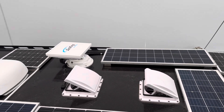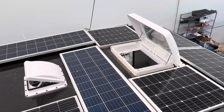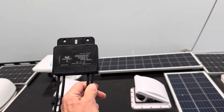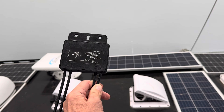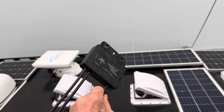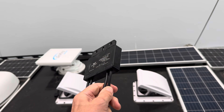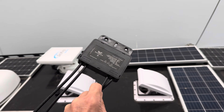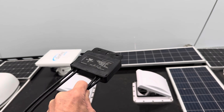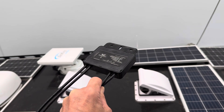You'll see the panels are of different sizes and different technologies — there's a poly panel there, a mono panel, totally different sizes. None of that would be possible without this little gadget here. You've heard of a DC-to-DC for an engine alternator — this little box here is a DC-to-DC for solar. I've put a quarter brick in here and it's using exactly the same technology, but it's a buck converter, not a buck boost. We've set parameters in here and that allows us to mix different technologies together and put them in one complete string.